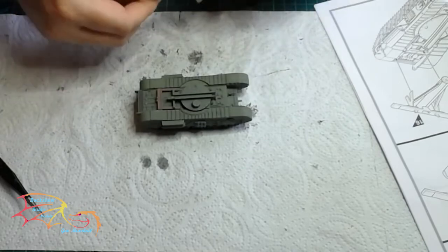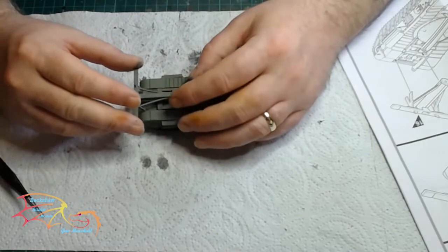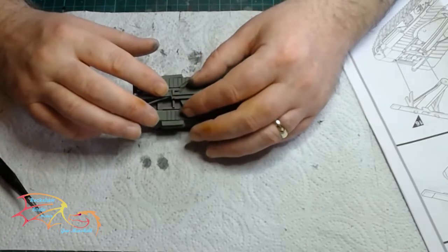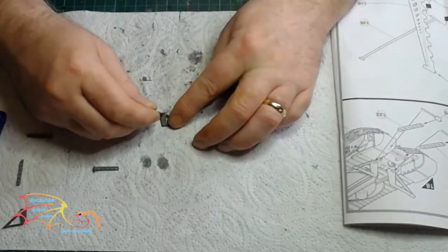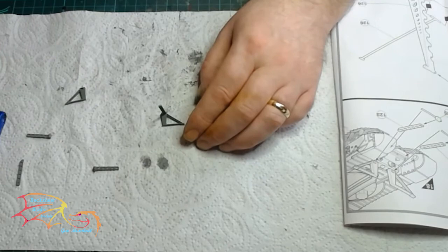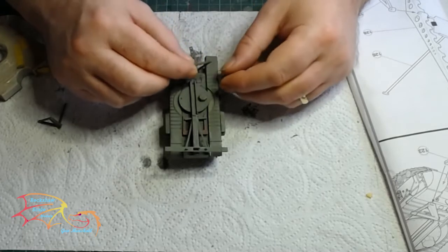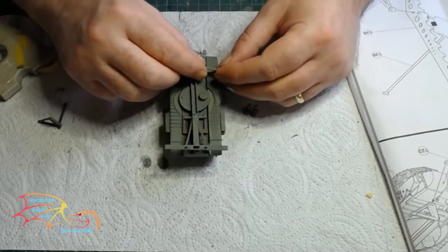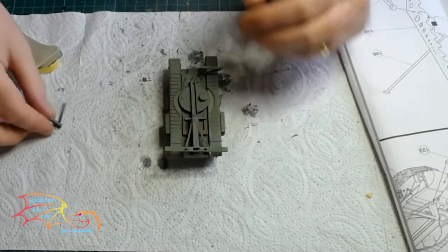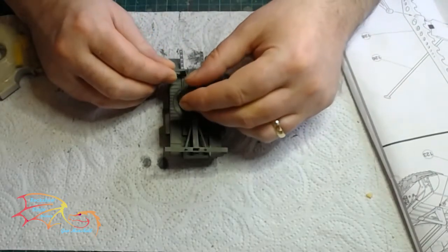So when I'm fitting the actual main bracket, take a look at where it's going to sit on the tank to the level of the piston ram housing. You want to get this as straight as possible. Next is a couple of brackets for the opposite end, and they're a simple construction, but the instructions are not really that clear. You have to really look at how these make up. First of all, make up the triangle part of the bracket first, with the flat extending piece which has the housing bracket for the wheels on it. So make sure that those two parts are together first.